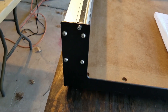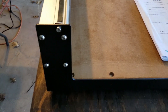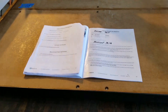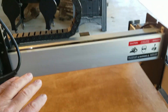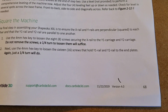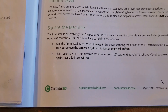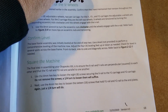These are all still loose. I kept saying we're going to come back and square everything, so you want to leave everything loose. They also want us to loosen the 16 screws holding the Y1 and Y2 rails to the end plates — just a quarter turn will do. I just went and checked them and they are all loose. Looking at the belt tension, it's putting quite a bit of force on this plate, so I don't know how easily it's going to adjust.